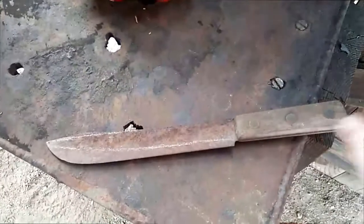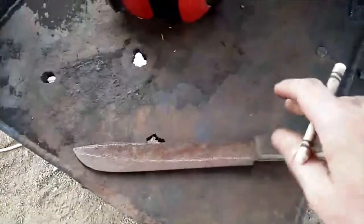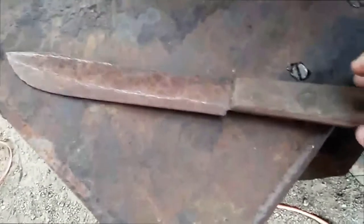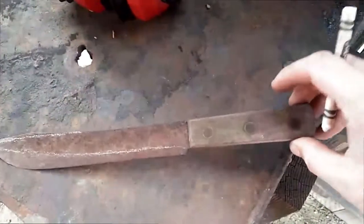So I think what I'm going to do is make a fillet knife for fishing. This type of blade would really work well in that application — it's really flexible. So I'm just going to get on the grinder and kind of profile it out, put a new edge on it. I'll probably do more of a convex slack grind using the slack of the belt to get a nice edge.